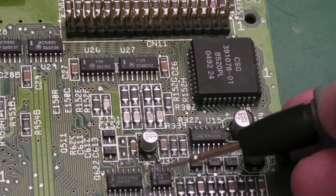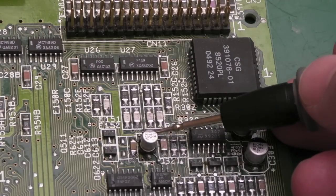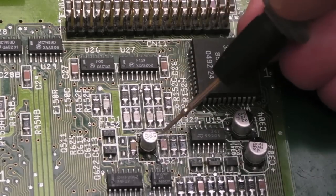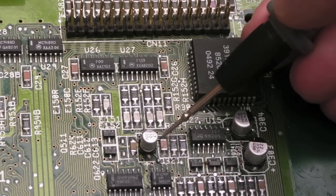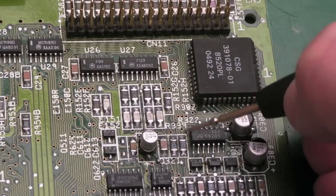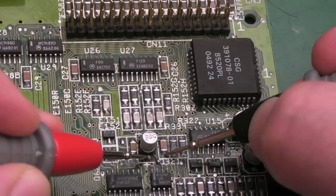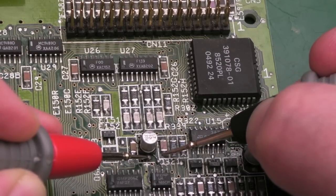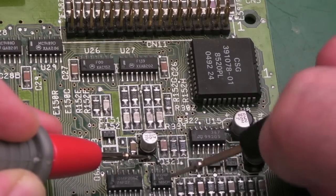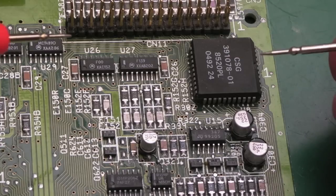But when I find that on the schematics, the 555 and these two pins going to the positive of this, I can then look what's on the other side and go, is there supposed to be two ceramics onto that same rail there? I mean, if this is negative, yeah, these may well be across the rails there. But then you'd expect that to be joined there if that was the case, and it isn't. It could be a different supply rail. It could be that this is for, let's say, the threshold or whatever it is on the 555 there.